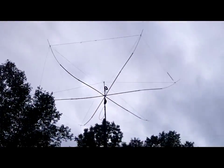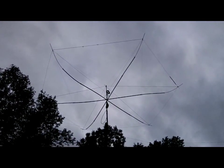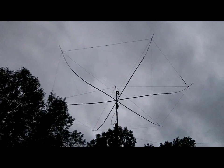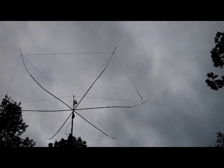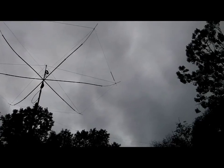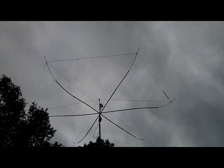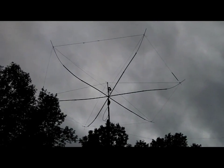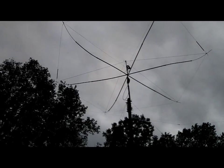There's my baby — I love my antenna. That is a 20-meter hex beam, homebrew, out of three-quarter inch and half-inch PVC and fiberglass driveway markers. Half-inch end caps with quarter-inch holes drilled through them for the driveway markers to slip into. She works great. I had to lighten it up because it was very heavy — scary heavy — and now she's good and light.